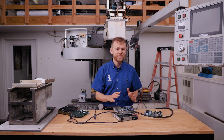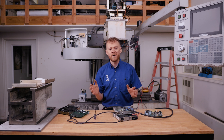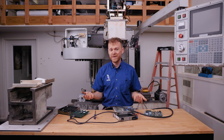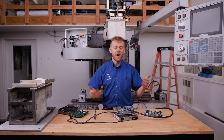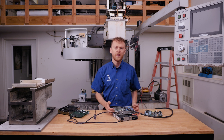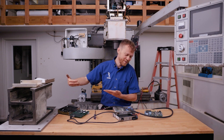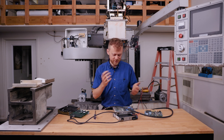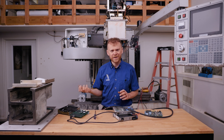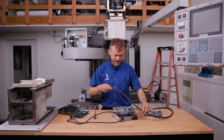So you've swapped the amplifier — you didn't move its physical location but you moved the cables, powered the machine back on, everything ran. Your intermittent problem now happens on the new axis that you swapped it to — that's probably an amplifier. Let's say you swapped it and you're still getting the X axis alarm. Well, maybe you have a ton of chips underneath it and whenever you move X axis it's grinding on those chips causing the overcurrent. Or your bearings are totally rusted causing friction. Or you have a bad cable.